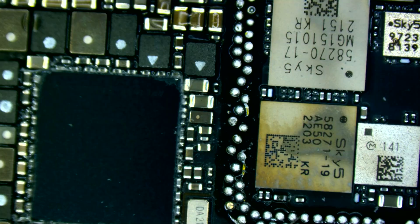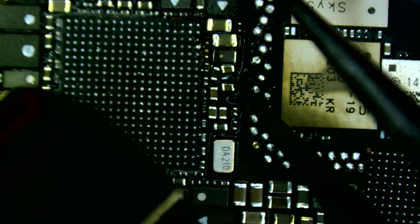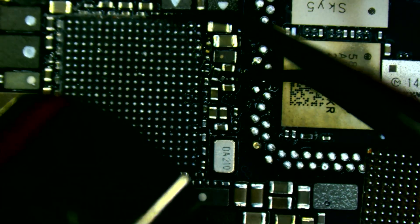After carefully using hot air around 300 degrees Celsius to go around the perimeter of the PMIC, scraping up the underfill down to the board to prevent components from lifting, you'll then need to come in carefully and pop it off. The PMIC being surrounded by so many small components makes it really tricky to lift, so there's no real optimal area to insert the tool while heating up the IC. A lot of the times components get knocked around, which can create a domino effect — bumping one component into another in a cascading nightmare.